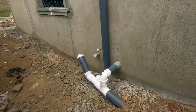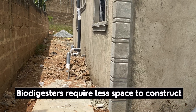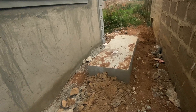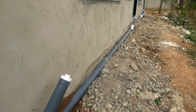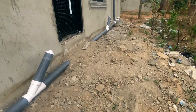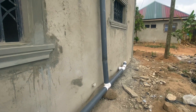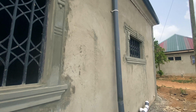If someone says 'let's do a vent for the digester,' do not agree to it. Let the vent be on the building itself and it will serve the purpose. If I were advising the plumber on this job, I wouldn't even consider two vent pipes — one is enough. They did another one here just for this section, which doesn't look great. So do you really want this thing on your building?